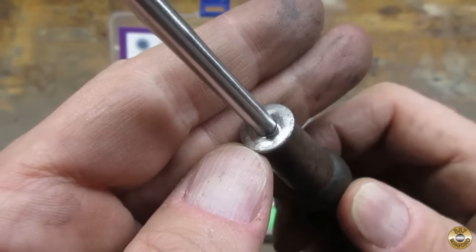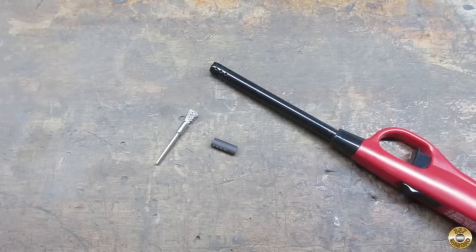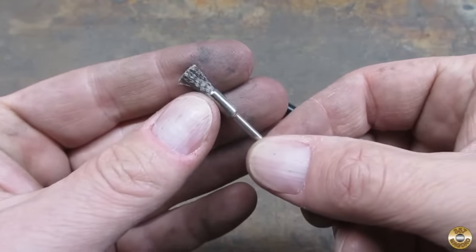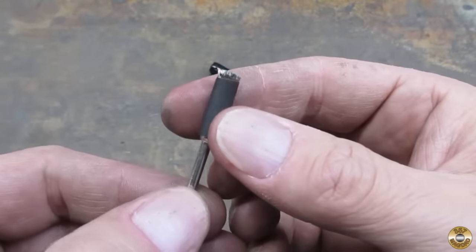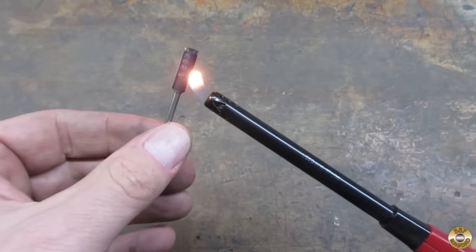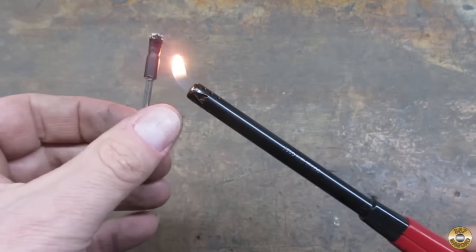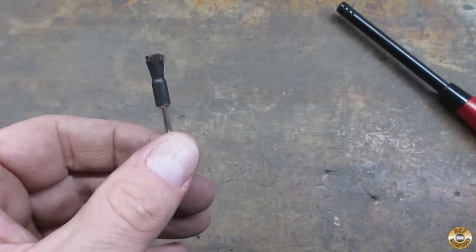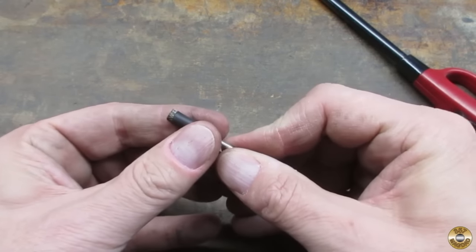Nice thing about these plastic abrasive bristle wheels is I don't end up wearing a bunch of little tiny wires. I've showed this trick before, but maybe someone new is watching. You take your cheap Amazon wire brush, a piece of heat shrink tube, run it up like that. And that concentrates the bristles. Makes it ideal for getting around lettering. Sometimes I'll even double up on the shrink wrap to add stability to those bristles.